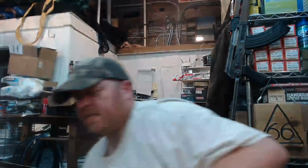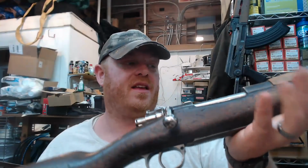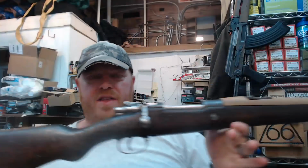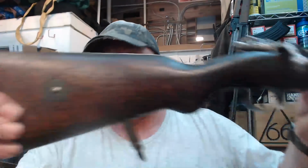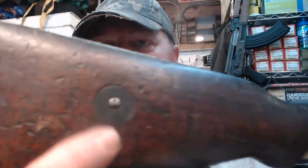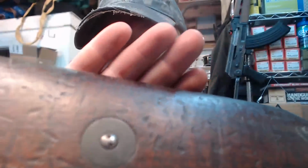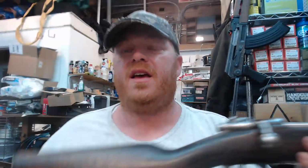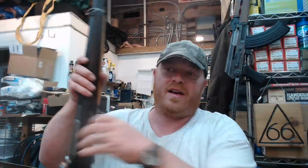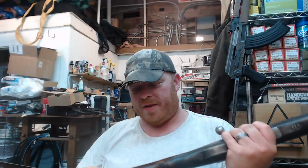Anyways, back to the stock disc. So where the German Mausers went to that takedown, the early Gewehrs and other countries like this Chilean Modelo 1912. This is a short rifle carbine. I've showed this in the past. Now this is a 7mm Mauser gun. This has a regular disc in the side. So the Gewehrs early production would have a disc very similar to this. And then as time went on, they switched to the hollowed out disc for the takedown of your bolt. So yeah, you can see them in two different ways.